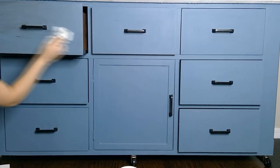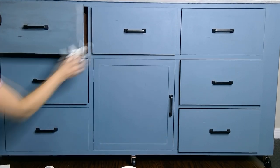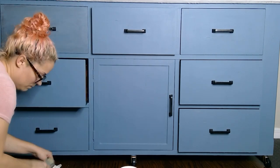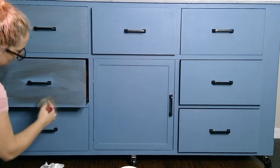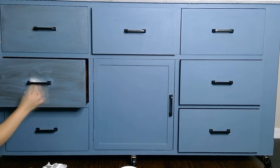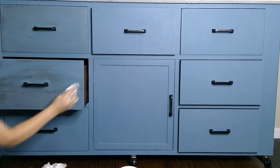The more rustic and distressed you want it to look, the more you fill in the little cracks and the grooves. Now, if you have a lot of kids running around, or you have animals or whatever, you can probably just leave this as is and let them do the job for you, which is why I'm only doing a light coat of the glaze and not such a heavy coat, and I'm not distressing it with any kind of sanding or anything like that, because my kids and my cats will certainly do that job for me.